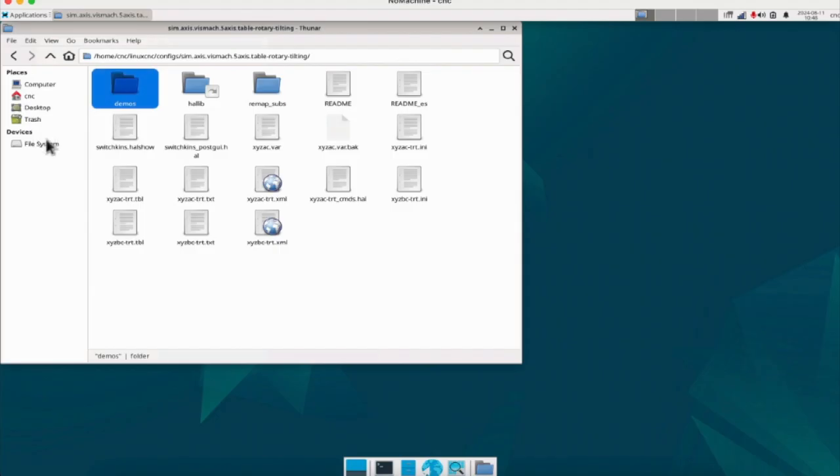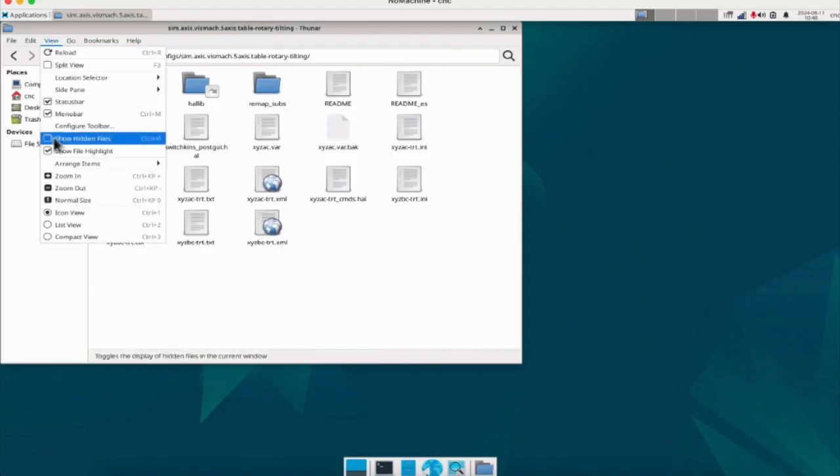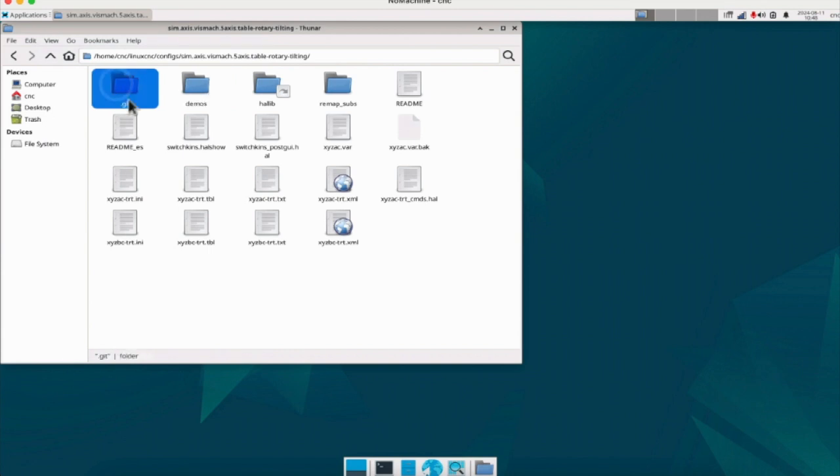Once back on the Raspberry Pi, you will see that a hidden folder called .git has been created. This is where your history information is stored, but you don't have to do anything with it, so just keep it in mind as knowledge. If you ever want to stop this version control, just delete this folder and you will be back to normal. Also, the folder with the Git folder is called a repository. You will be using the word repository a lot from now on, so please remember it.